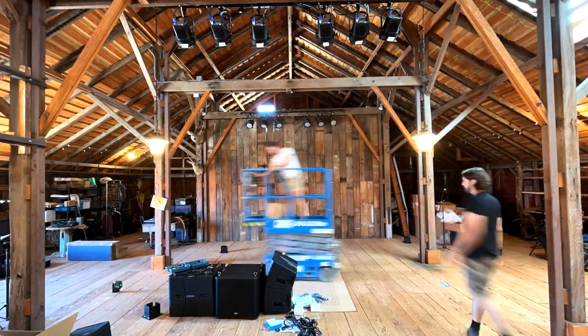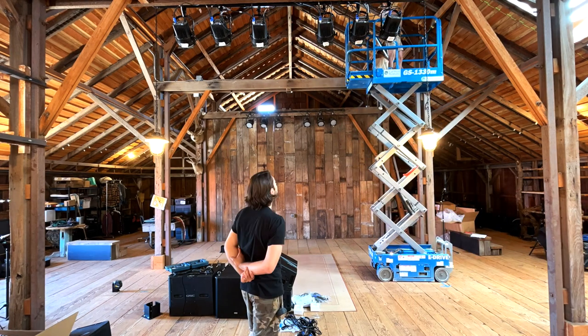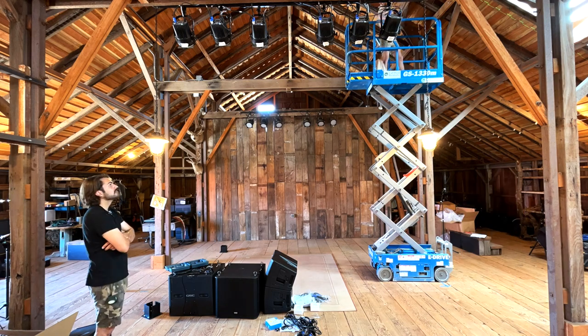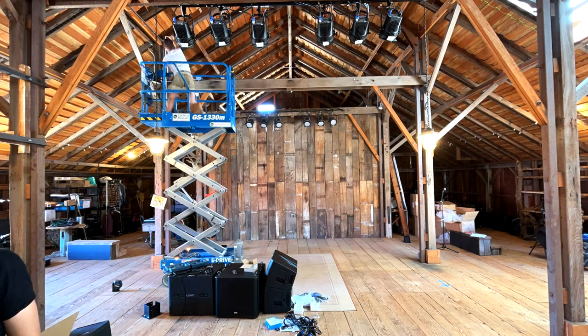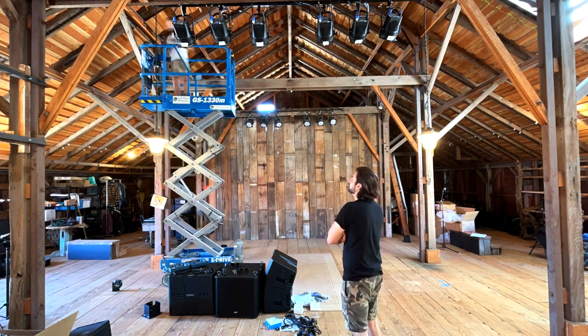We began by laying out the footprint of the stage and made sure the front of the subwoofer would be hanging plumb in line with the front of our finished stage. We threw a laser line across the ceiling and marked locations for our bolt holes. We used M10 steel eye bolts through the 4x6 rafters, and the chain we used was rated for 1,800 pounds.